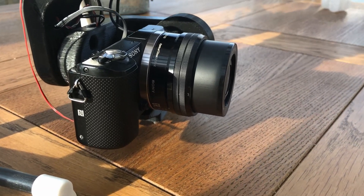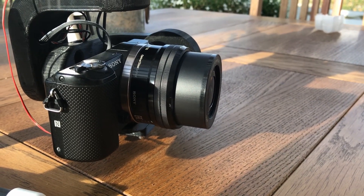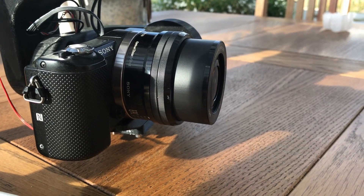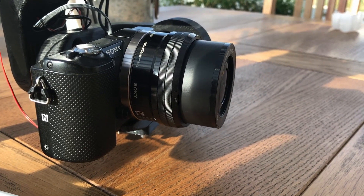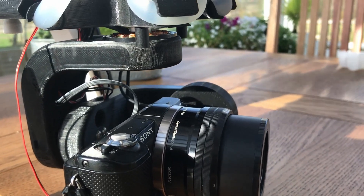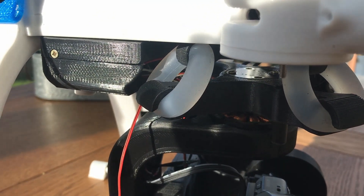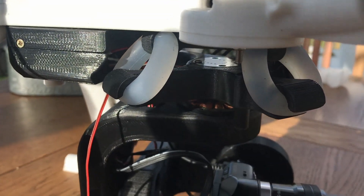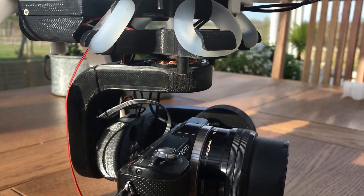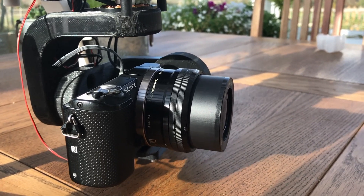So you've seen the video of the vibrations from this setup. I'm thinking it's not so bad really, especially as most of the video was taken on a 50mm zoom, and it's perfectly fine with photos — there's no obvious shake visible with photos. But it's not great for video, as you've seen. This is probably the third different arrangement I've made for suspending the gimbal. Some gentlemen may recognise these silicon rings. It's quite a low frequency, fairly well damped oscillation that you get. And as you've seen in the airborne video, it is doing this as the copter tries to keep its position in a bit of a breeze.